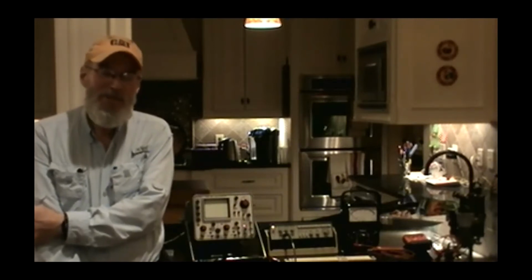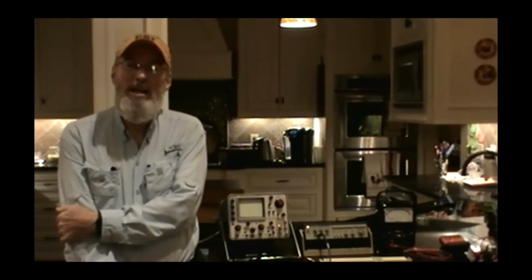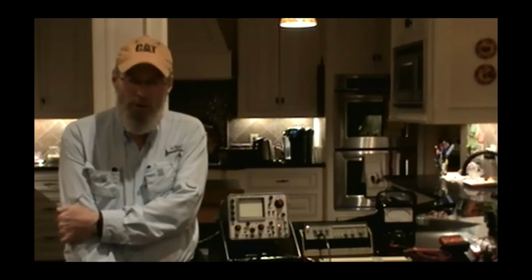You're a kind soul indeed, and I have to say you're quite good at making an old guy feel useful, and I appreciate that. And I'll tack something on to your story about George's rig catching on fire. We also had a common history at WZZQ with an old Visual brand FM transmitter that caught on fire. It arced holes in the cabinet. It burned up contactors, breakers. I was down there one night when it struck an RF arc, which ran for several seconds, and then it discharged 7 kV at 5 amps into the side of the cabinet and knocked a hole in it.